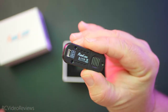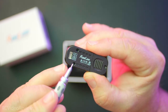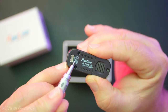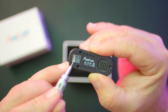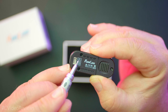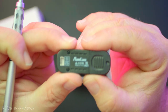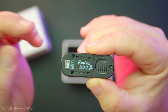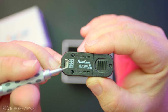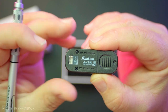Around the back of the camera, you've got the sole input for power. When you have it wired up to a flight control board, you've got an RX connector, a TX connector, and then ground and DC 5 volt. The package comes with a connector you need for that. It's up to you to wire in your RX, TX, ground and 5 volt to a source you can use. In the case of a flight controller, that's a really easy connection to make. In the case of fixed wing, you're going to need to use something like a BEC wired to that DC 5 volt and ground to provide power to this camera, as it has no battery.